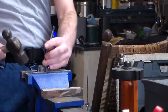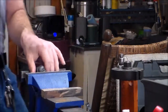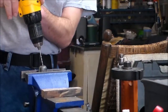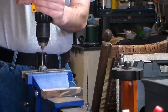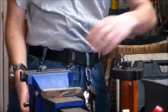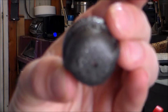Got a punch from the toolbox. This is critical — looks like I got a good hole, let me get this straightened out real fast. Number 40 drill bit in the drill — go easy, these things are tiny. You want it as dead center as possible. And we're through. These pieces are just your average standard plumbing pieces. You can see the tiny hole right there — that is our jet size. That is what the gas is going to come out of.